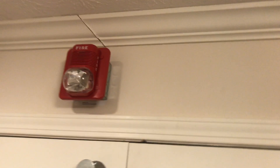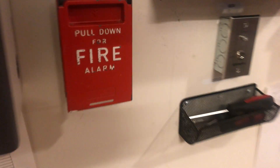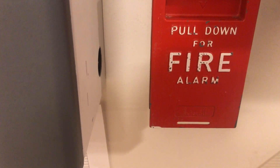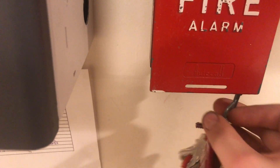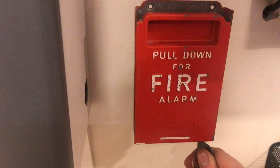That's unfortunate that they landed in the litter box, but it's fine. So to reset an Autocall 4015 pull station — if you can find it, there it is — you take your flag-style key, put it in the bottom, turn it, and then just slide it up. And now everything is reset.